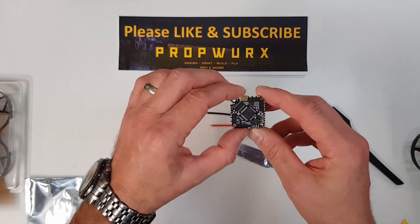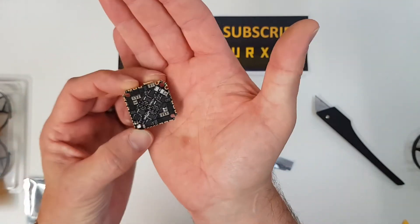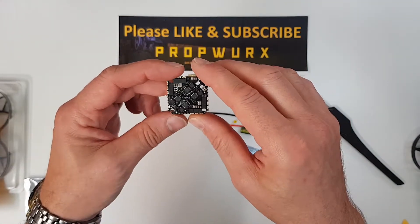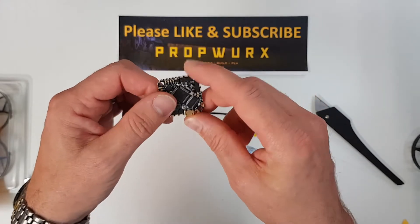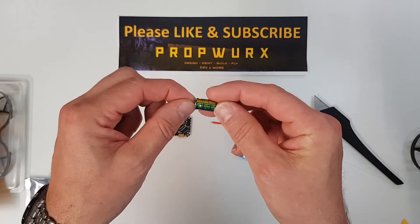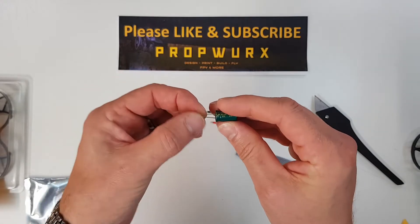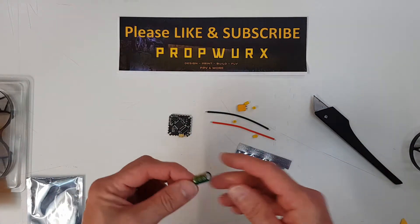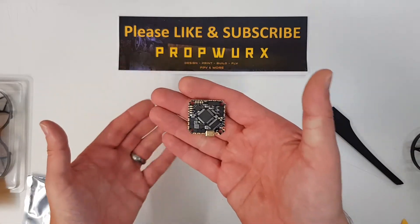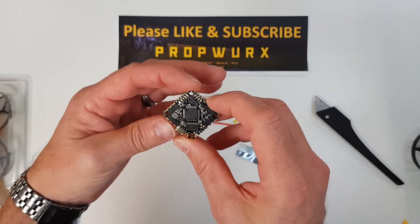It seems to be nice and tidy. We'll soon see about filtration — you've got quite a few bits going on here, and for this size of board I wouldn't expect masses of filtration. They've also stuck on a rather large 35-volt Sanyo capacitor — I'll probably swap that out for a Rubycon or a Panasonic. But yeah, got a decent-sized capacitor in there. The board itself looks tidy, the work is clean.